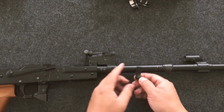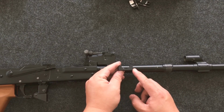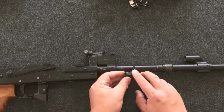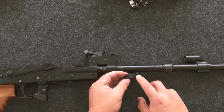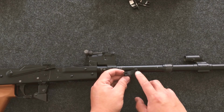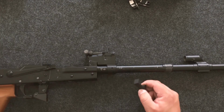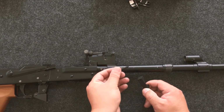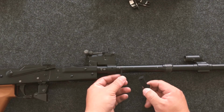Now the clamps. For version 2, I decided to go with a completely custom clamp. This is not the original Magpul clamp. This is a totally newly fabricated clamp that has the ideal radius all the way. And instead of using the number 10 fasteners that Magpul originally uses, these are using number 8-32, so the thread pitch is the same. The number 8 fasteners are plenty strong for this task. There's no worry. I would have loved to use number 10s, but the design just did not allow for it.